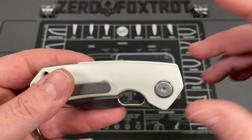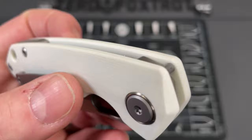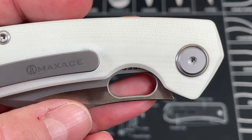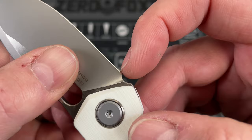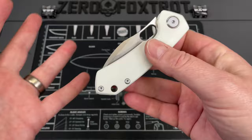Now just a couple of things I'm not over the moon about. First, there is a spot right here that is very close — I can actually touch the edge of the knife at the back of the choil. It's really tight quarters at the top, and that's something you want to look at, especially if you're going to grab this as a work knife without gloves — that is kind of an issue. I can open up that choil, and speaking of the choil, it needed to be a little longer anyway because it ramps up — it needed to come out about that much farther.